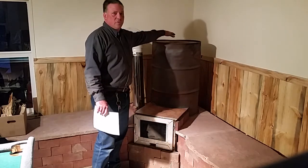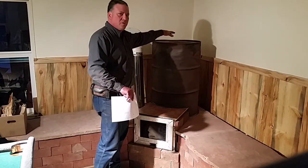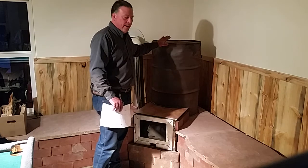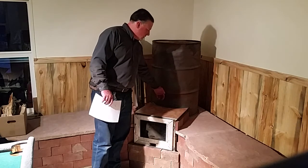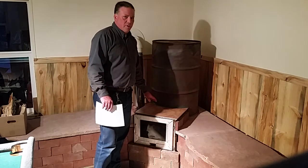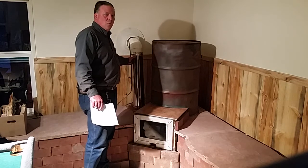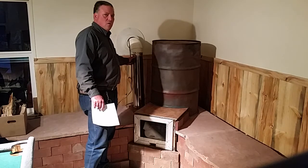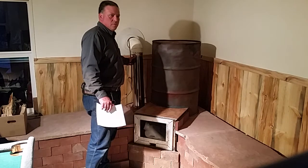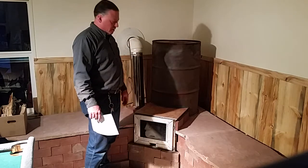The temperature rose quickly and also decreased quickly. When the fire started going out, the bottom of the barrel didn't get too hot — maybe around 250 degrees. The nice thing about the stove vent is it never got over 120 degrees at the most, going out — maximum temperature on the stove vent going out was 120 degrees.